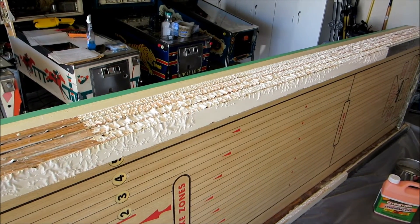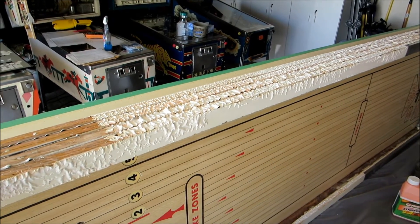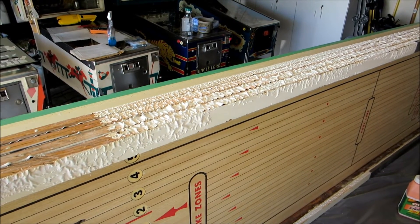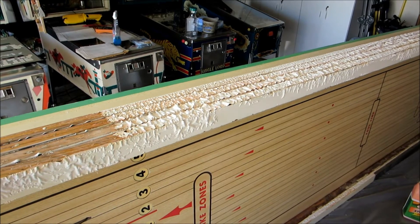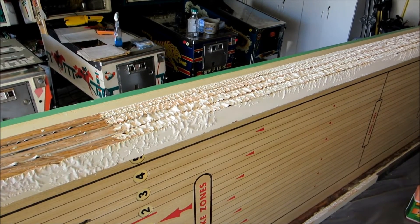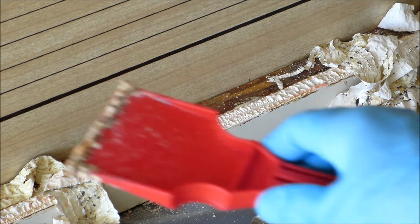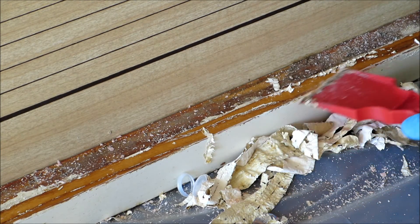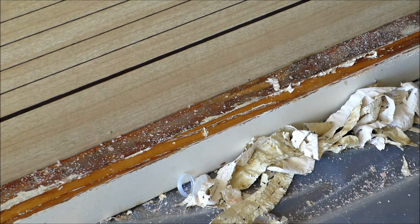After sitting for a little longer than an hour, you can see the horizontal surfaces work great — I think that's gonna scrape right off. I tried the vertical surfaces and had mixed results, but I'm going to be rotating this thing around so they will be horizontal briefly. I'm gonna wipe this off and probably try wiping it down with isopropyl alcohol to see what it does to the wood and get any remaining gel off so it stops preventing any finish I might apply. Thought I'd show how easily this comes off — comes right off. I think I'm gonna have to hit another coat because it's kind of in the grain a little bit, but I can just dab it on where I've got issues. Comes off really nicely though, and it's no fumes — you can use it inside. This is the stuff: Citrus Strip. That's what you want to use.